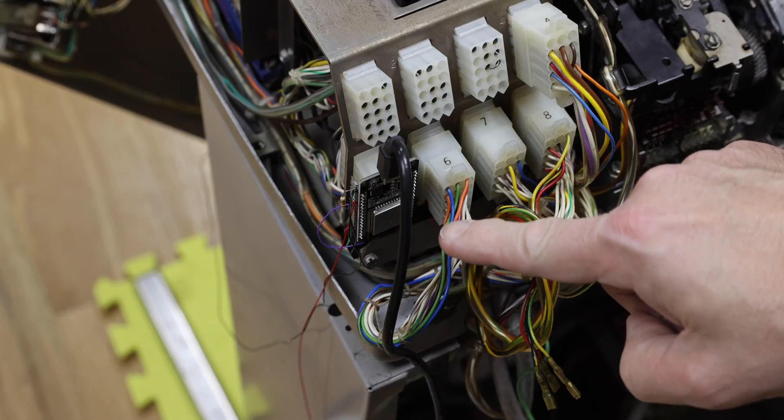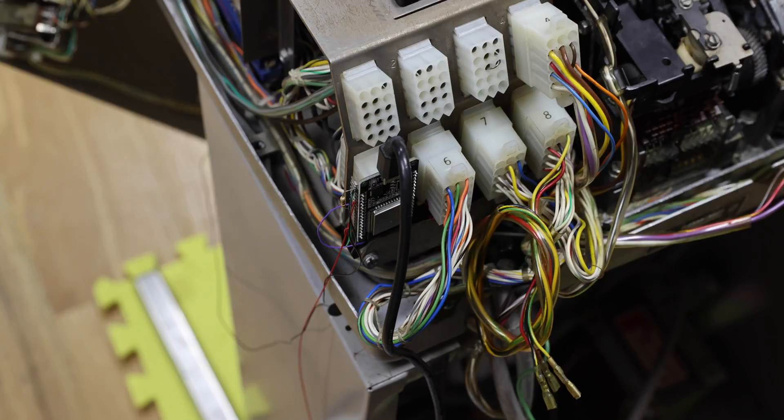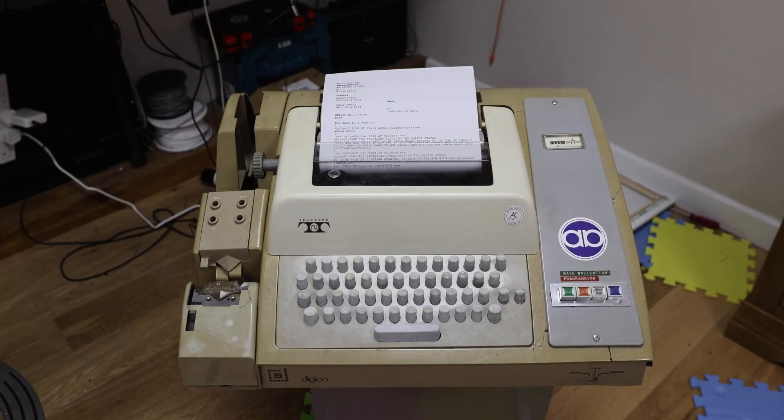The whole lot is then controlled by an ESP32 microcontroller, with literally a 100 ohm resistor being used to drive the 20 milliamp current loop. That's how an ASR33 teletype actually works — it really is an amazing mechanical marvel. I do wonder what it would be like to replace all of that huge amount of electronics with something modern. I suspect we're talking about a tiny little power regulator and a tiny solid state chip to control the selector solenoid — that's all you'd need. It probably replaces the whole of that end section with a circuit board the size of a postage stamp. Thank you for watching. I hope you found that quite as amazing as I found it when I was working on it. It really is quite incredible.